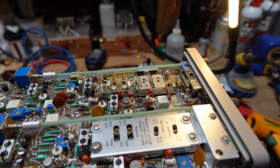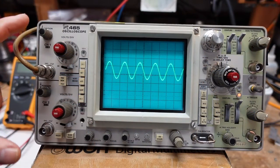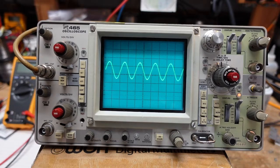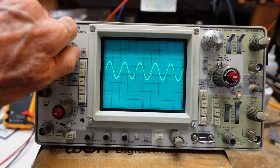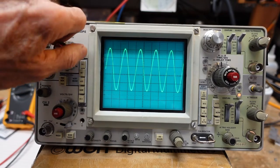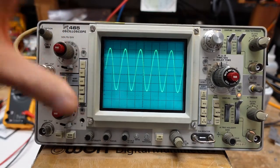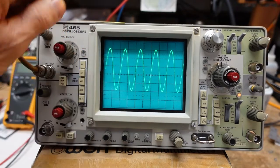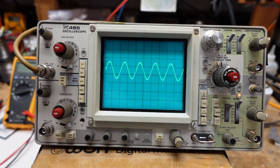I'm going to plug it in and take a look at it. I'll move this so we can see it and check if that did the trick. As you can see, I've got a display back on here at 0.5 volts peak to peak. Now when we move it, it looks a lot more correct, more linear. We don't have that huge jump going between 0.5 and 0.2 — this is correct. That's usually all it ever is on these.